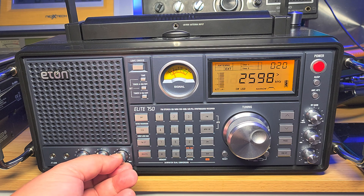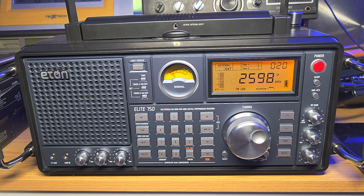Remember: utility signals — the majority are upper sideband. In the ham bands it's half and half — upper sideband above 10 MHz, lower sideband below 10 MHz — with exceptions for utility signals and digital signals which are generally all upper sideband. Just try to learn the rules. It's a learning curve, but slowly you'll be able to tune around. If you enjoy my videos, please subscribe and give a thumbs up — thank you for watching.